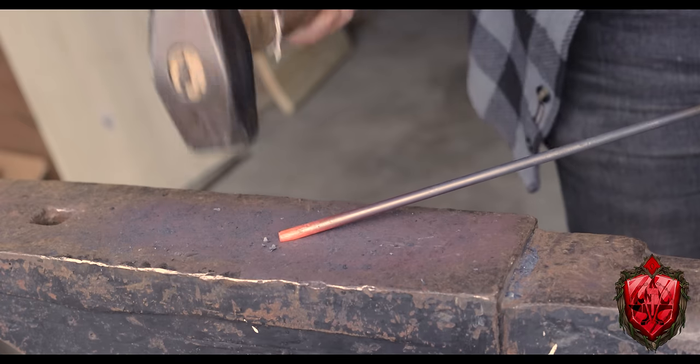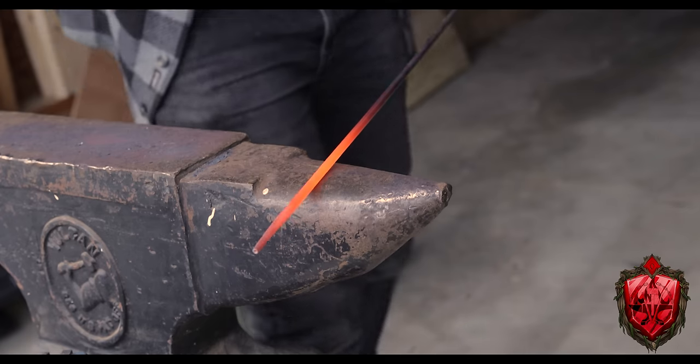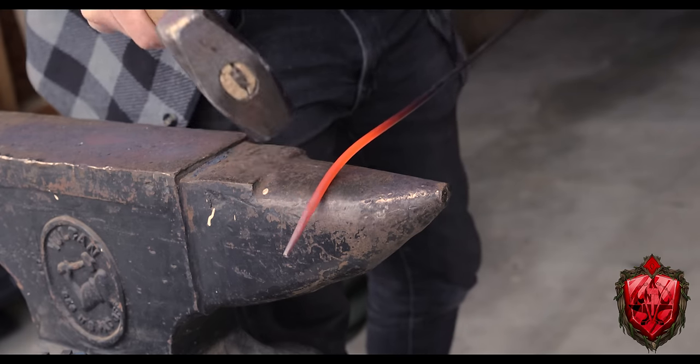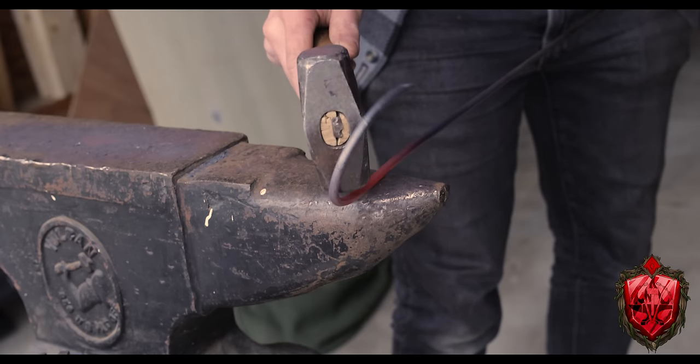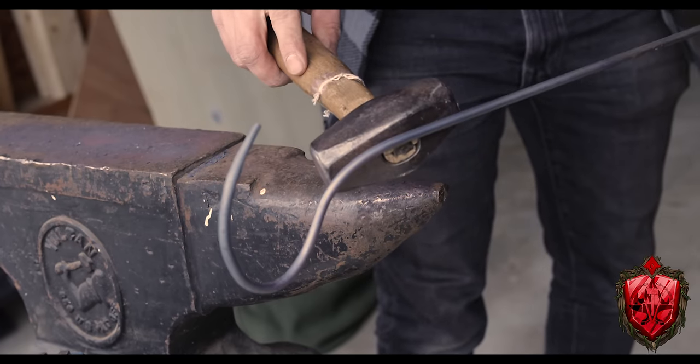That's all I wanted. To do this, I used a slightly thicker bar. I think it was like 1/4 inch bar. Used the horn to shape it around to make a nice large hook. And then again, to bend that hook in on itself. Remember, anywhere that you're going to be putting force, you want the place that it'll be hanging from above the point of force. So if I left the loop out here, every time it hung, it'd want to swing back so that it was in line with the point that it's being held up on.